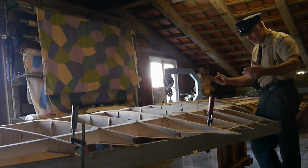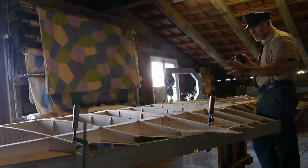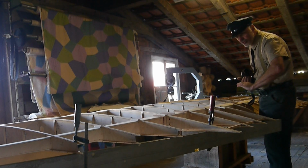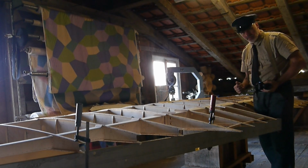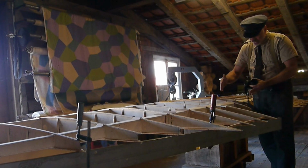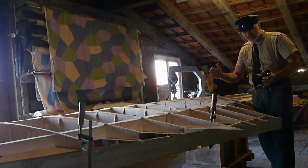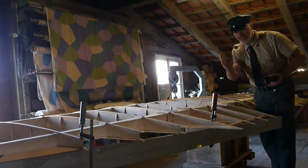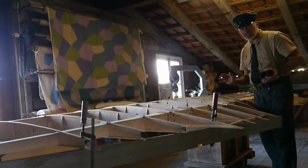The same, of course, applies to wing building. See, the ribs, for instance. Of course do they have a certain shape. And of course they have to line up. And of course the continuous flow of shape-shifting must be kept over the entire wingspan. But when they are pulled onto the wing spar, it must not be on a tapering spar that the gap exactly is as wide as it has to be in the position where the rib eventually comes to rest. A certain gap is required to move the ribs around, to adjust them, to line them up. Them spars are planed by hand. They are not 100% uniform to the tip. They've never been. Even back in those days they haven't been.